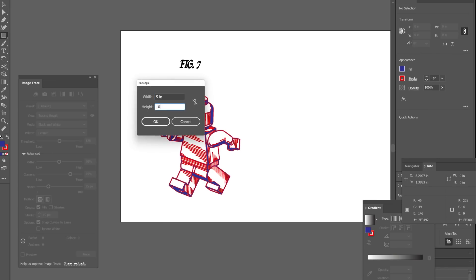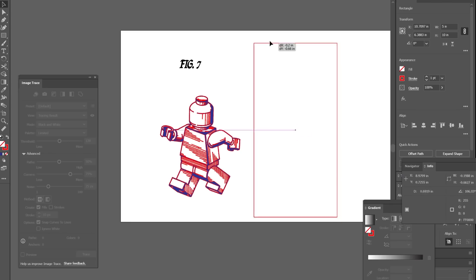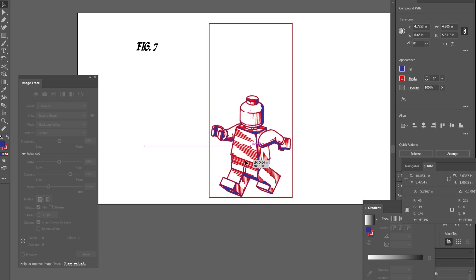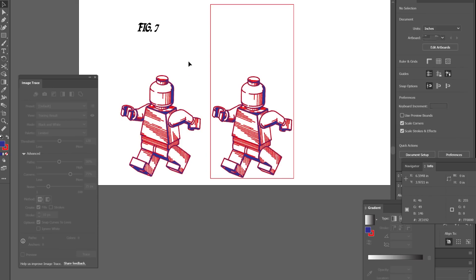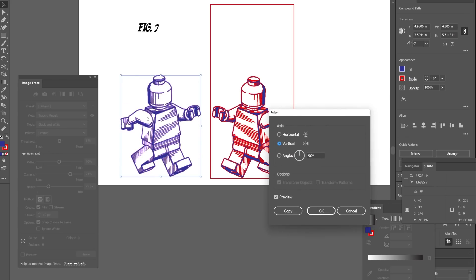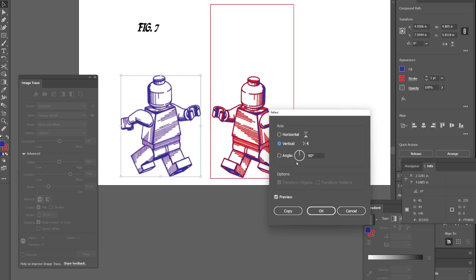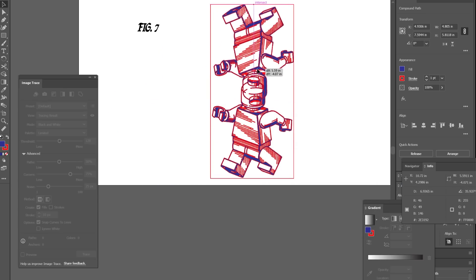So we have our outline, and this is not actually going to be the clear piece. The idea is to stack the layers of acrylic - an opaque piece, a clear piece, and then another opaque piece. This represents maybe the top layer, which is going to match the bottom layer, so I'm going to duplicate it and cut out two of these. If I was using acrylic with a specific finish, I'd want to reverse it, so I'm going to mirror it along the axis. That bounding box represents the size of acrylic I have: five inches by ten inches, which I can fit both pieces onto with a little scaling.